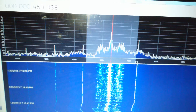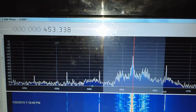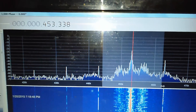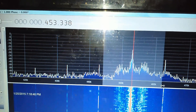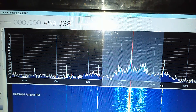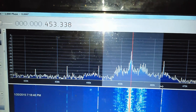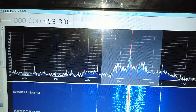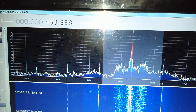What I'm doing with this radio — we don't have an IF output — so that's the AM IF, and that's pretty close to what it should be running. Most radios run them at 450–455 kilohertz. With old radios like this, they often weren't exactly set right — the dials were calibrated and the IF was set to whatever the IF was set to. Believe it or not, there were people who cared more about where the dial was sitting than whether the radio actually worked right.